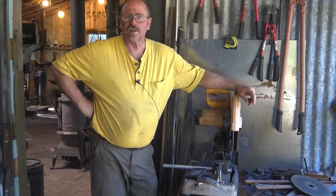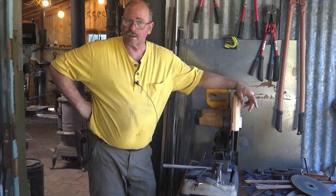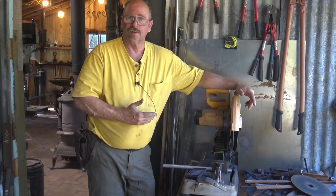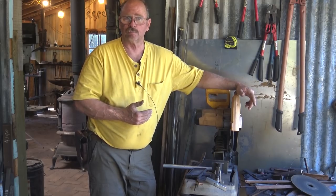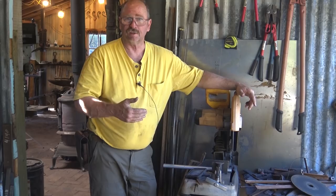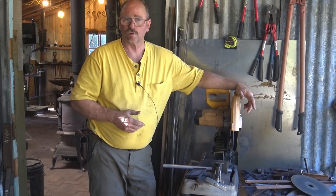The next issue was turning roughly a hundred bars per order into usable stock sizes — a lot of cutting. A chop saw seems to make sense, but it isn't as fast as it seems when you're cutting that much material. It goes through blades, which cost money and lower your profit margin. They also use electricity, are noisy and dusty, and carry risk if a blade breaks. So a chop saw wasn't the ideal cutting element for us.